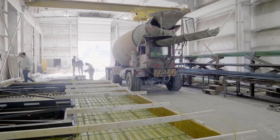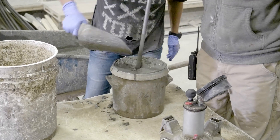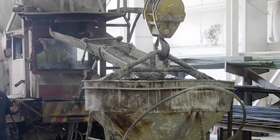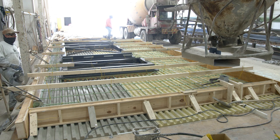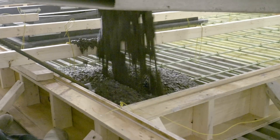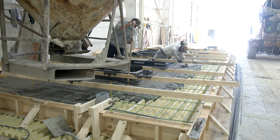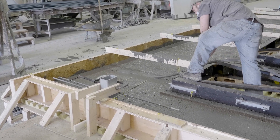The on-site ready mix truck drives into position. Some concrete is dispensed to be tested prior to pouring into the form. A variety of tests are performed in compliance with PCI standards. The mix will also be tested for color and temperature. Retains are taken for strength tests performed at various curing stages. To help place the mix into the massive form, the concrete is first transferred into a holding bucket and raised overhead, then dispensed and distributed evenly into the form. The mix is raked and leveled over the form as needed. A vibrating wand is inserted in the still-wet mix and is used to eliminate surface bubbles and honeycombs within the panel.